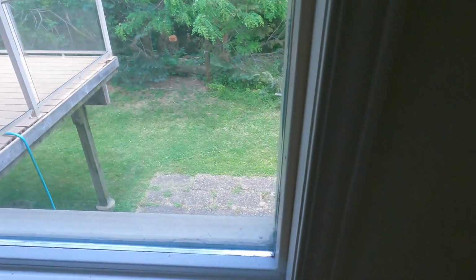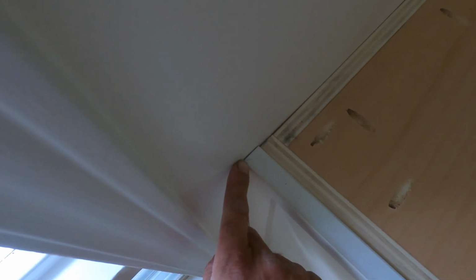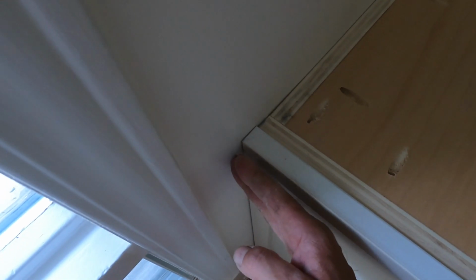Also, when I cut that panel, I'm going to put it on a 45. So basically, I'm just going to draw this. Maybe not a 45, but when you look down on it, it's actually going to be a sharp point. That sharp point's going to help me press it up against the wall so it's going to fit nice and tight into that paint. So I will have to use little to next to no caulking, so it's a nice tight fit and everything looks seamless and clean.